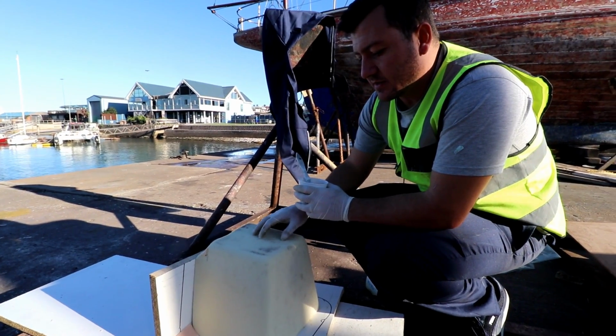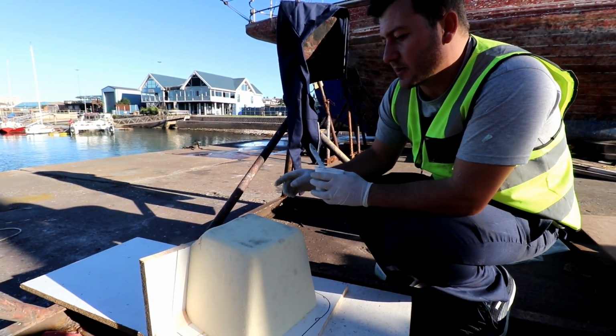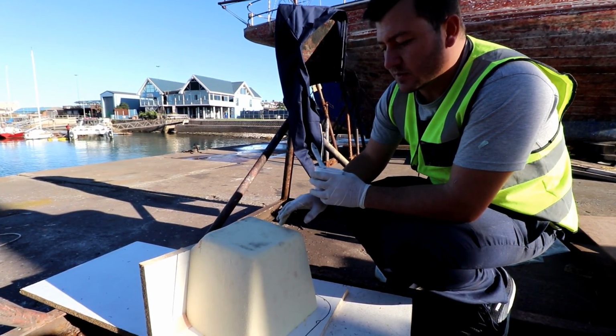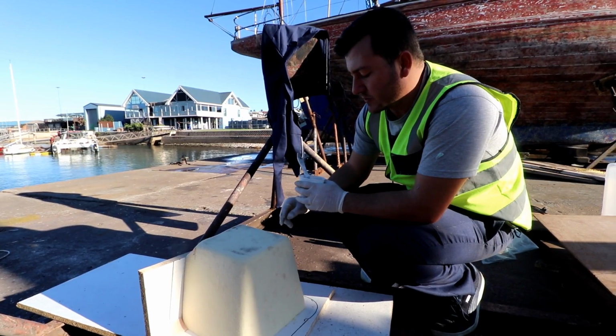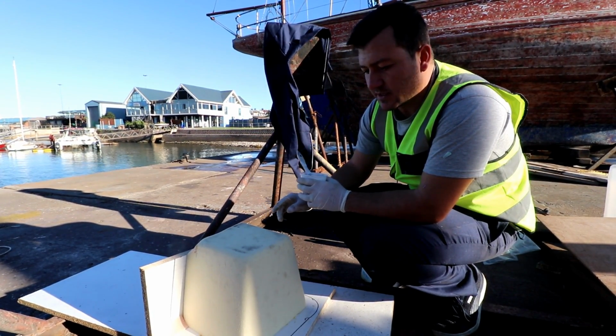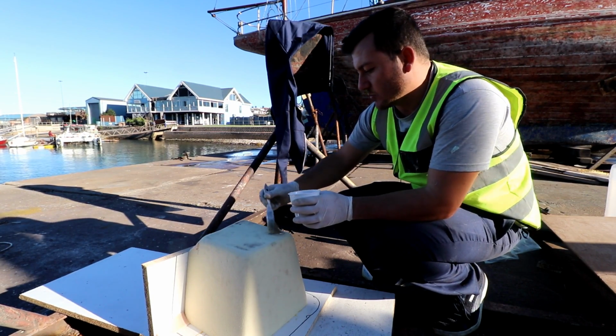So I built the plug, and I'm just going to pull one part out of it, so we're not too fazed about it. What I am going to do is seal this foam. This is open cell urethane. Just going to seal it up with some resin and then sand that down nicely, and that will be our base where we're going to take our part out of.